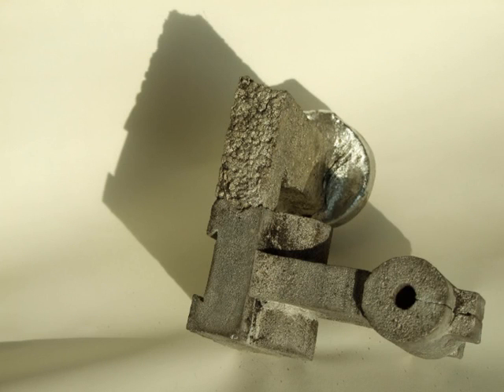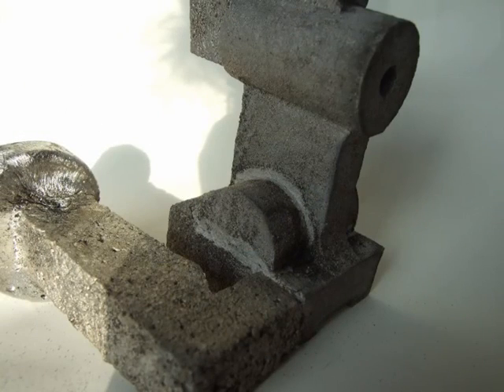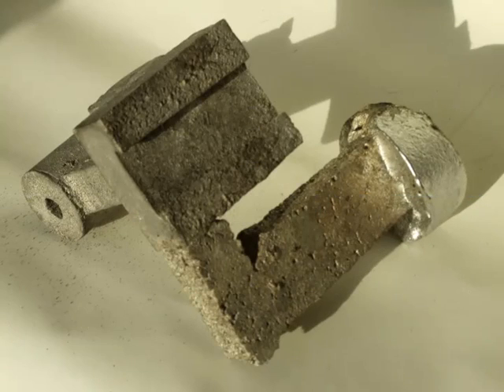Two D-shaped pieces of card were cut out and glued to foam blanks. Then the two pieces were cut out and glued in place to the drill head with PVA wood glue. PVA glue was also used to form fillets. A white foam sprue was again hot glued to the assembly to feed molten aluminium to the bottom of the pattern.